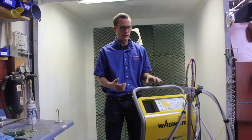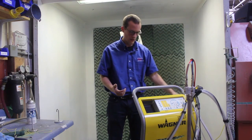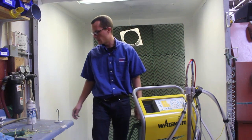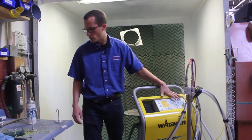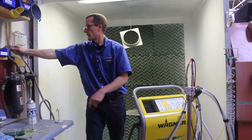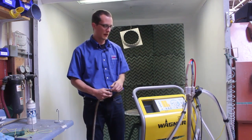Those are the basic principles you need to know to get ready to use this unit. We will go ahead and start the unit up. There is a power cord on the back and a power button on the back that is your main power disconnect, which has to be on. There is also a button on the front of the unit. You have to have compressed air, which will drive the pickup tube that feeds powder to the powder coating gun.